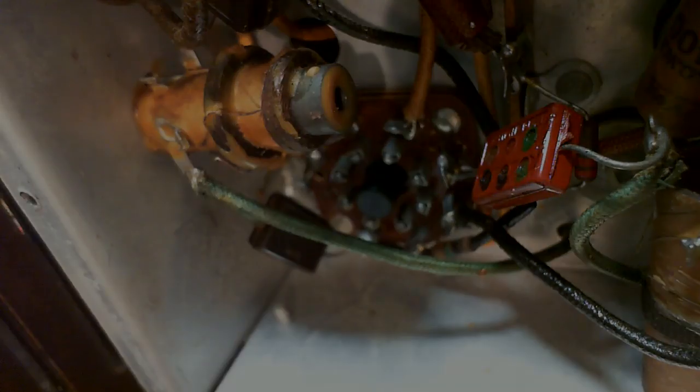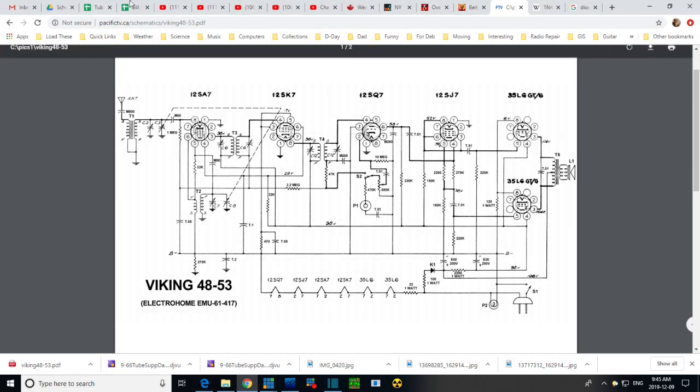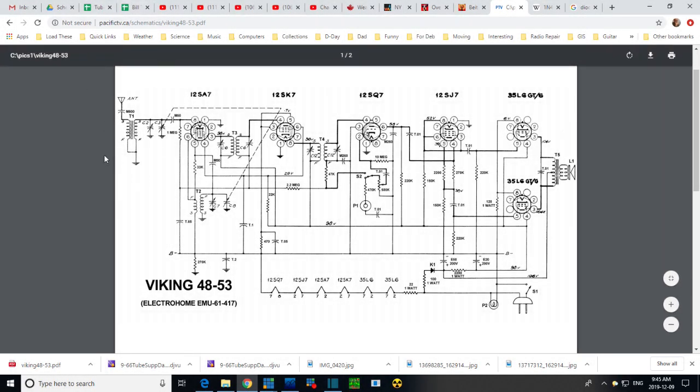Okay, let's go. Seen enough. Okay, so here we're looking at the schematic. Here's the first coil. I mean, that's clearly a transformer, T1, two windings. This shows a metal core. Those lines usually indicate a metal core. See, there's no core shown here or here. These are air core transformers. This one, the output is a metal core, and there's the metal. Why do they do that here?